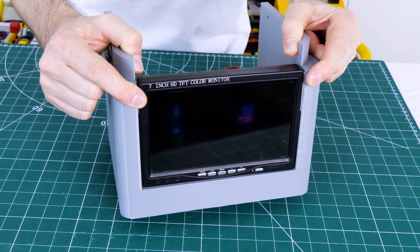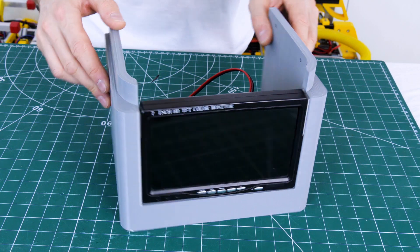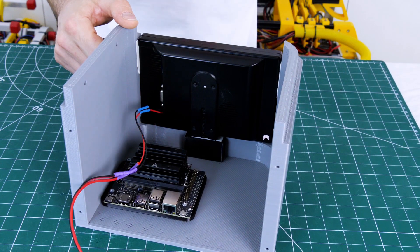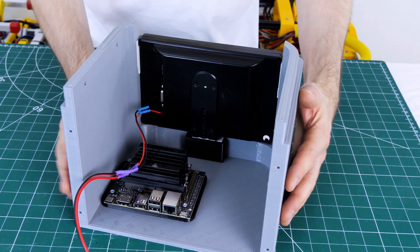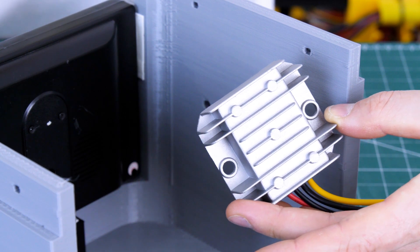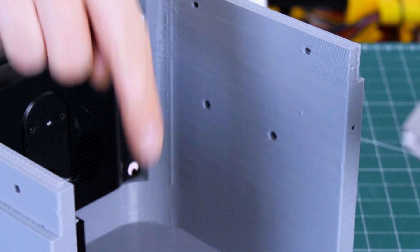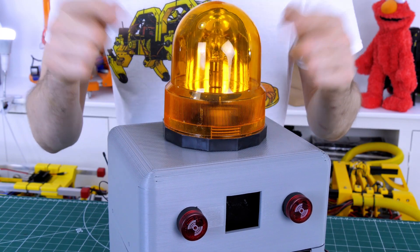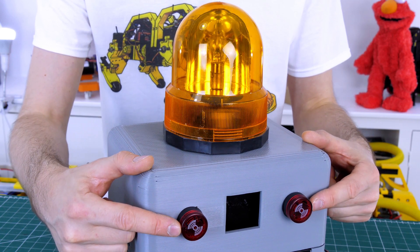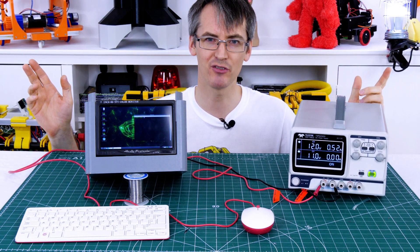In the front of the box is a 7-inch TFT monitor. This thing's absolutely rubbish — we're just putting it there so we can see the screen. Around the back it does have HDMI and VGA but the power connector snapped off ages ago so I've soldered these wires straight to the PCB. Inside we've got the Jetson Nano, basically a whole computer in a little box. Also mounted on this side is a 10-amp 5-volt regulator I quite frequently use for powering Jetson Nanos — so we can put 12 volts in and get a decent 5 volts for the computer. On top we're mounting one of those revolving orange lights I've had kicking around for about 6 years, and I've also got some very annoying illuminated buzzers in the front. It's all booted up — I'm powering off a bench power supply at the moment. I won't be sending a power supply or batteries. Batteries not included, there's no budget left. Also no keyboard and mouse provided.